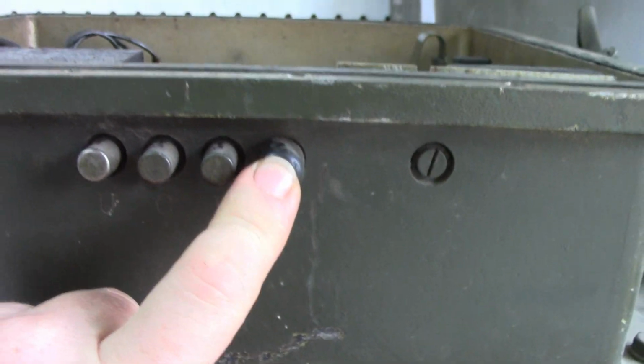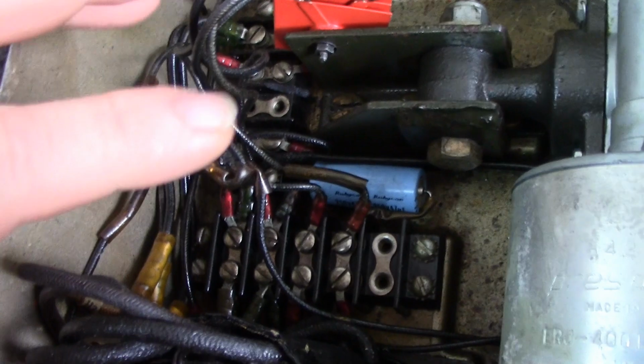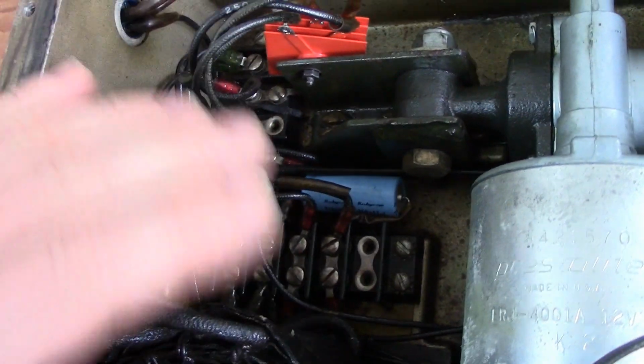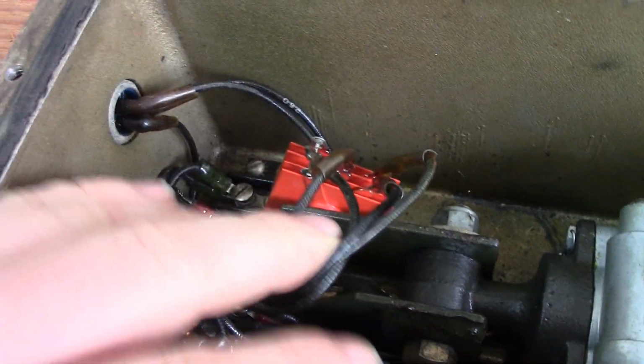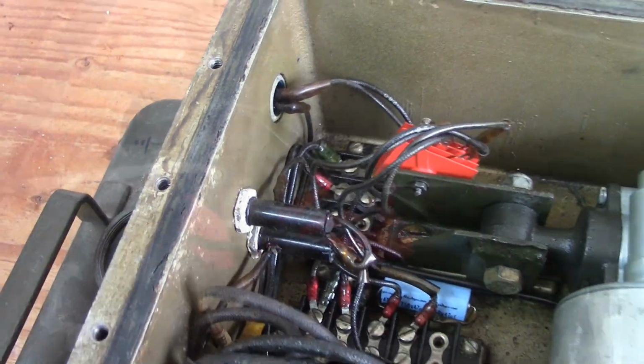It is insulated, first off. Second off, that wiring runs off and goes to one of these fuses and then disappears into this area here, which is marginally high voltage. I'm really not sure. But everything else here seems to be in okay condition. So I say, at the risk of blowing up the selenium rectifier, which if I can get that on camera, that'd be cool, let's just supply 120 volts. I can see where the wiring goes in here. It was marked. Shouldn't be that difficult.